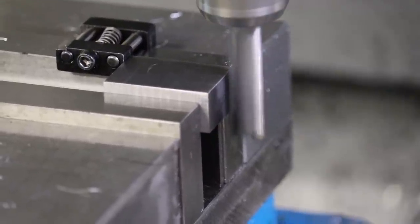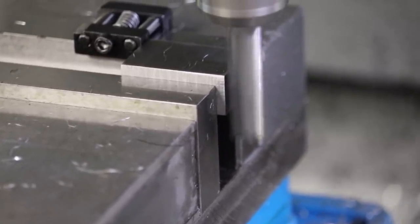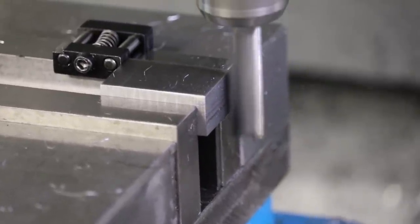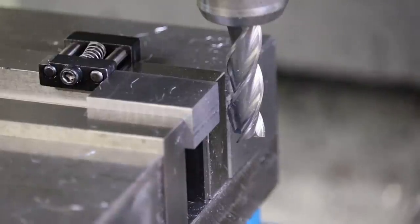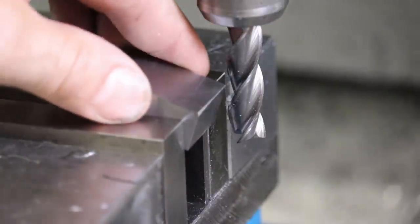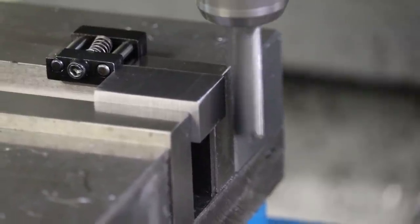I also have the mill stop set up on this mill, as you can see in the background. In fact, I should probably flip the stock around and get rid of any residual out of squareness from the off-the-shelf grind. So maybe I'll do that. One second. Making sure the end mill's off, of course. I'll slap that up against our mill stop. This should be 1.5 thousandths.